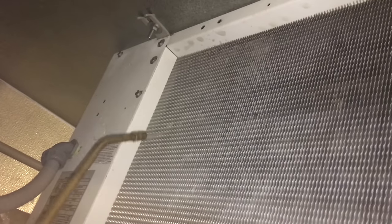You want to make sure you totally rinse off all that Nu-Brite because that stuff is real aggressive — it's a base or acid, I just know it works good. This coil wasn't real dirty but I like to keep it clean because this customer is particular about his place — he likes everything in top-notch condition. He knows that clean evaporators and condensers work better, cost less to run, and means he's not replacing compressors all the time or having problems getting to temperature.